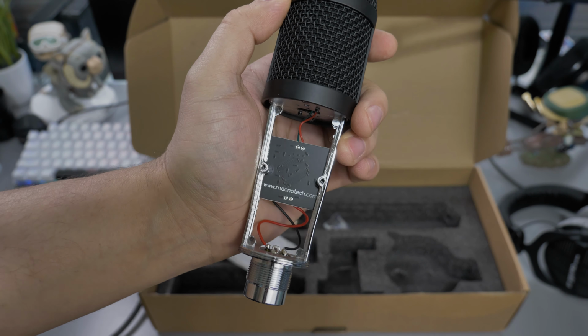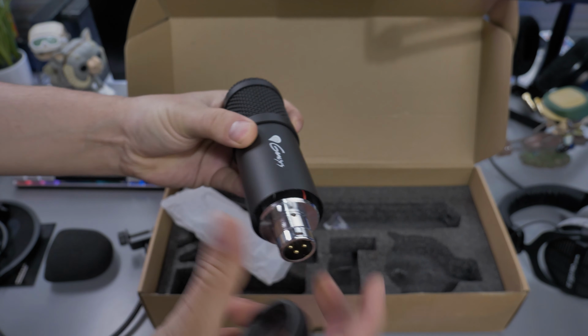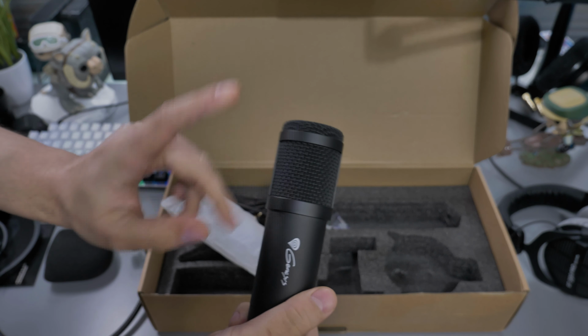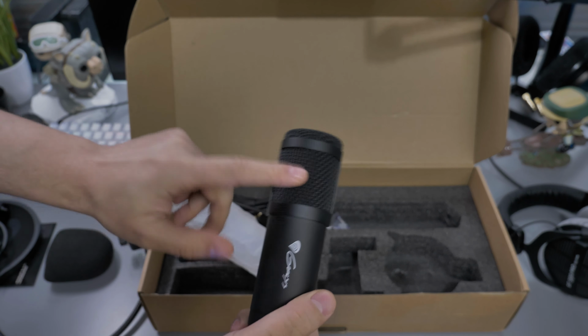And again, I couldn't find a dynamic on there. Their microphones are pretty decent, actually, for the price. I also noticed when I was talking into it, it was very good front on, but when I talked into it from the top, like I can do with my Rode Procaster dynamic, there was a noticeable audio drop. So again, I'm really thinking this is a condenser microphone. It could be. I did speak to a friend of mine who's quite into audio gear, and he says you can get some dynamics that will take 48 volt phantom power, but they're generally quite higher end.